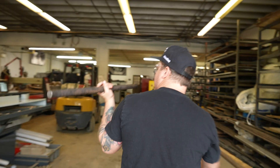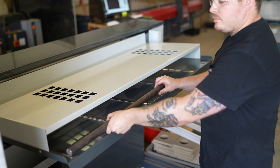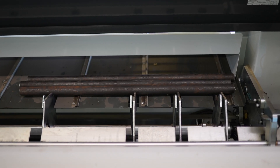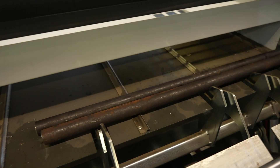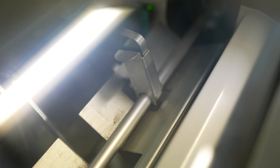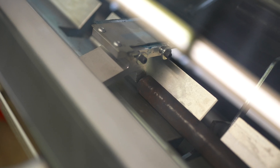That's why we have different lengths here — the bigger material is a little bit shorter. Right now we're running chromoly for our bungs. We go around here to the back of the bar feeder and load it up here, slide it down. We can pop this open — that's our tray. Once we're at the end of a bar, the bar feeder measures it, knows there's no more material for a part, rotates a new bar in, reloads the push rod, and just keeps going.